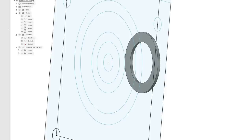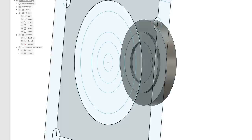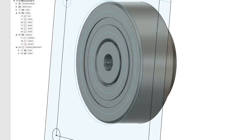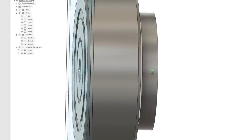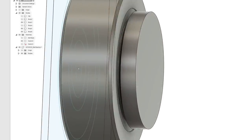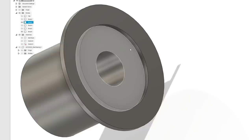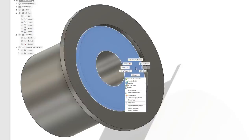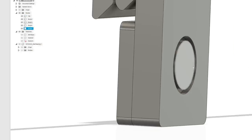Cool. Now see how we have a little bit of a flange there? So that's what we want. Although I think we could probably also fill it in. Okay, and then we'll connect it to this portion. Now the profile view will probably make a little bit more sense. See? So we're only compressing the plastic under the inner portion of the bearing that rotates. That way we're not intersecting with the other parts that rotate because obviously there's two mating sections to a bearing. Same deal, we can't leave this gap in here. So let's get that measurement and then we'll extrude this out to match that. So extrude that distance. Yeah, so this needs to come out a little bit more as well.